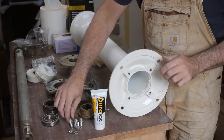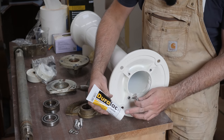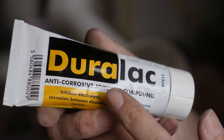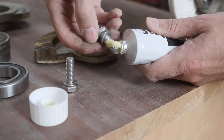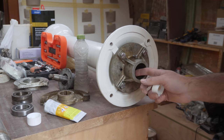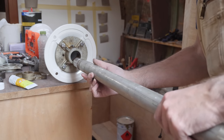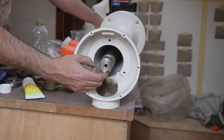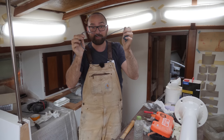The column is aluminum and I'm going to be using stainless steel fasteners to secure stuff to it. Wherever I'm combining the two I'm going to use a little dab of this anti-corrosive jointing compound — there are a bunch of different products that all serve the same purpose and I've never used this particular one before, but it's got a delightful yellow color. There's an o-ring in here that I'm going to give a tiny dab of lube before we get to the shoving. After a little bit of persuasion it all worked out — it's in there now and rotating nicely. Before I go any further with the assembly I'm going to run this piece of line up through the column.